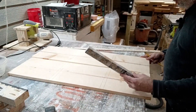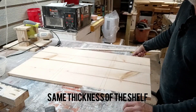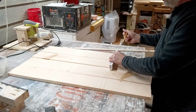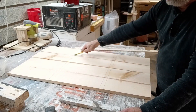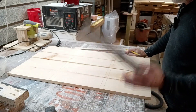This thing here is a block — the same depth as the wood, the same depth as the shelves. I'll lay it below the first line and score another line behind it. Then I'll mark X's there, because this is where the shelf is going to sit right inside those two lines. It's the same depth as the strip here.